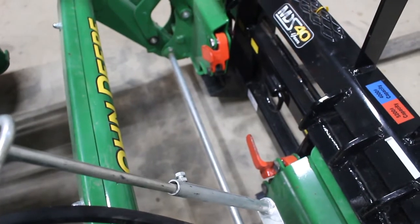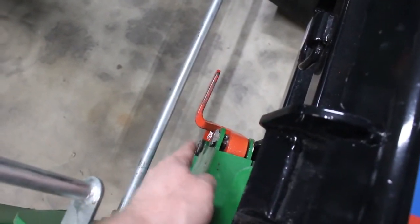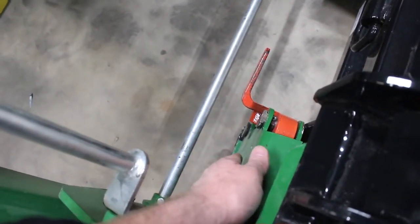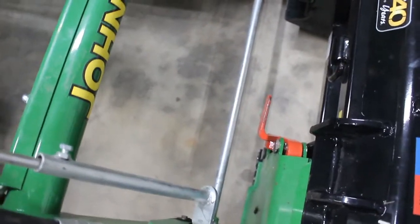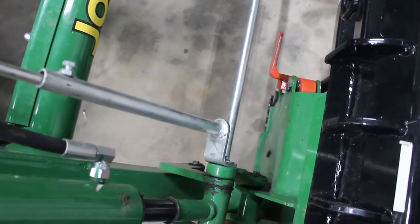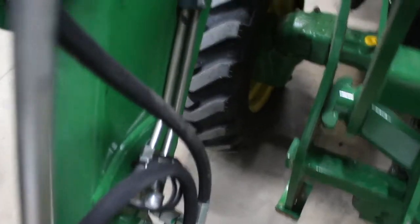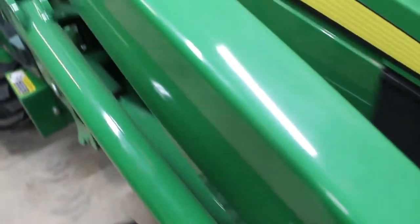Here's the front of the 4066. I have tried to fit the linear actuator in there and it fits fantastic. The linear actuator will go in here, probably facing this way. Wiring-wise, the wire will probably run from here to this bar right here, strictly because I don't want the wire to get caught up in any pinch points. Then I'll send the wire up alongside the hydraulic lines.